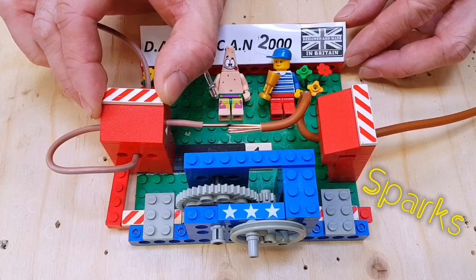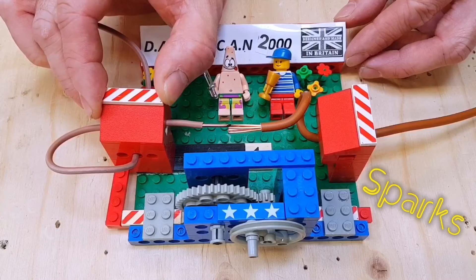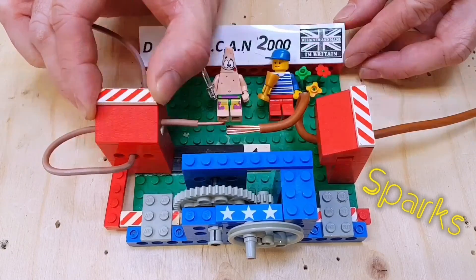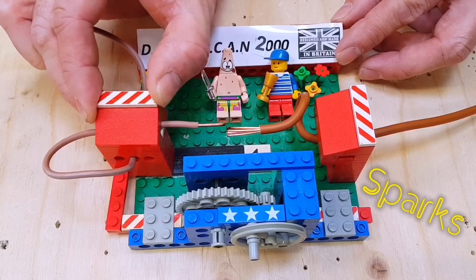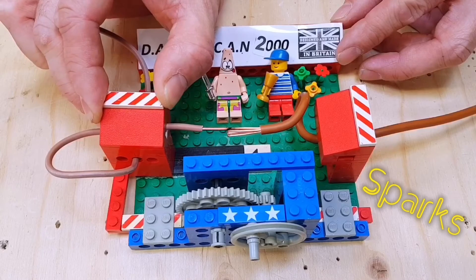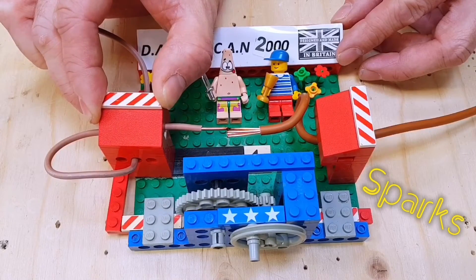Can we suggest that it's activated the arc fault detection device at this stage, David? Well, I certainly wouldn't want to touch it myself - these connections here still look energized to me. We've also got a massive risk of fire. Pulling it apart actually seems to create a bigger arc. It still hasn't tripped. There's no activation yet, and yet there are some rather high temperature localised events happening.